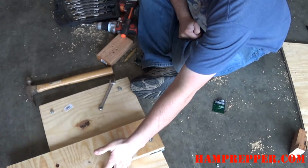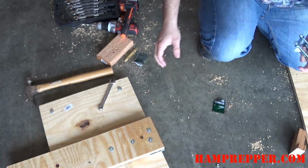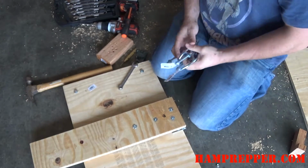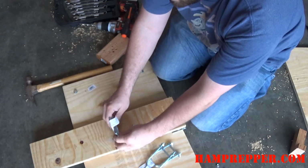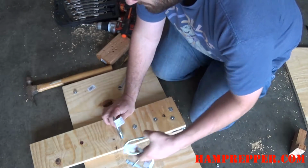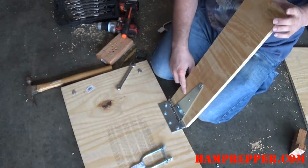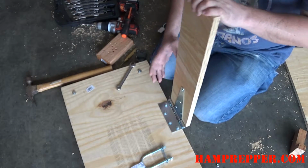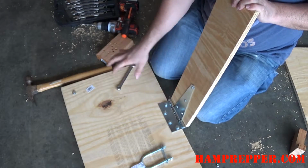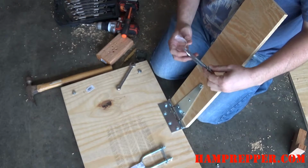So we need to think about drilling holes for the 3 U-bolts. The question is where do we want to put these? And my guess is that I'd like to put them all above this because I don't want to short to this. These go through to the ground, and even if we load this whole vertical and this is just sort of touching the ground, there'll still be some resistance through the ground. So keep these up here so we can use this wood as an insulator also.